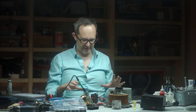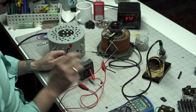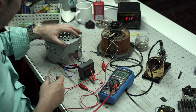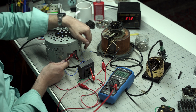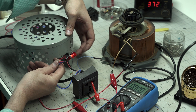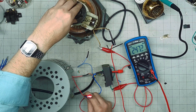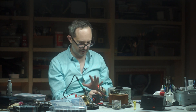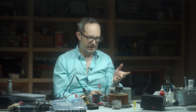This looks like a complete mess, I understand, but basically all of the wiring except for the fuse is now in place and connected. So we're going to run a little test — I'm going to plug it in, and once I hit that switch, this red light should come on and we should start getting voltage we can adjust from the variac. Zero volts — red light is on — and there's our voltage coming up, and it tops out at 247 volts. It's working! Now we just need to put it all together, find a home for this red light, see if we can sneak in a fuse holder, try to make it look pretty, and hopefully we'll be all done.